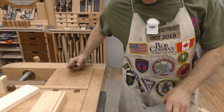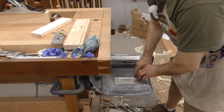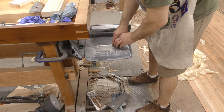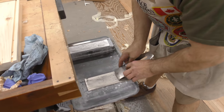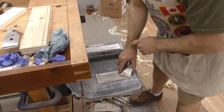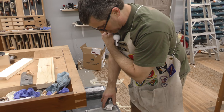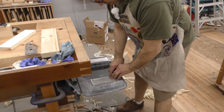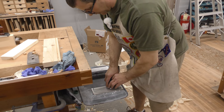Here's how we cure it. My bench height is just a little bit above my knee — it'll be a little different for everyone — but it allows me to do primarily two things. Number one, by leaning over top of the stone, when I want to cover more of the stone I can shift heel and toe while doing my little circles. And you want to make sure that you keep that blade on an angle as you're doing those circles so you're staying on the stone. The biggest advantage is that you get to move your pivot point from your wrist all the way up to your shoulder. When I'm in position to sharpen, I lock my wrist, I lock my elbow, and pivoting is from the shoulder. Find your primary bevel, elevate two or three degrees, lock everything, and just do those little circles, slowly migrating out over the stone to even out the wear.